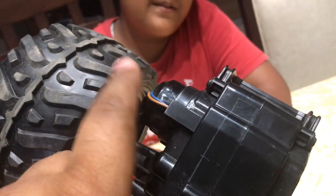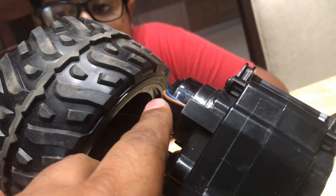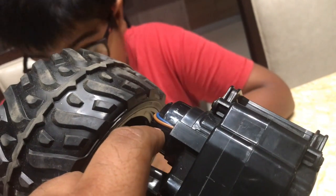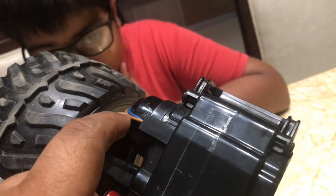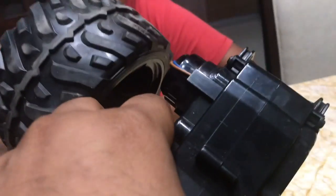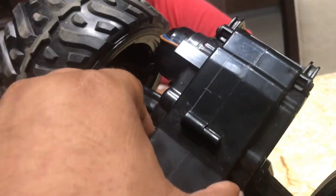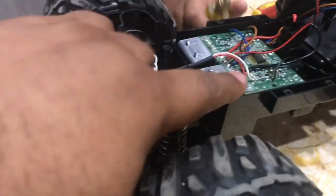This brushed DC motor has got three wires coming out of it. Normally DC motors have only two wires, but this has three. The brown and blue wires are the power wires — one positive, one negative. The third black wire is for noise suppression, because being a thick motor it will generate a lot of electromagnetic interference. This black wire needs to be connected to ground so all electrical noise is dumped to ground and doesn't interfere with other low-voltage electronics in the circuit.